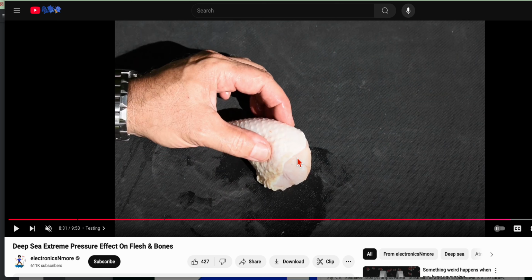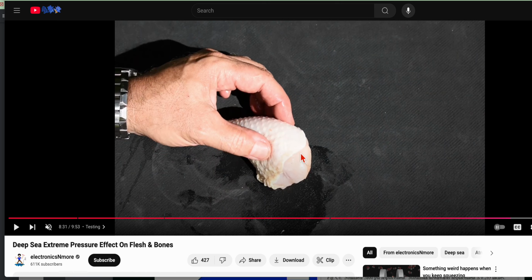So as the pressure comes up, it hits the chicken leg equally everywhere. Think of the Rhino liner. And even though it can get under here, it does not, because the pressure outside is maintaining it tight to over here. It's equal. Not one is greater than the next. So let's say it's 1,000 pounds here. Well, it's also 1,000 pounds here. It's resisting the peeling effect, if you will. It can't peel it up because 1,000 pounds fighting 1,000 pounds is a wash. So it can't peel it up.